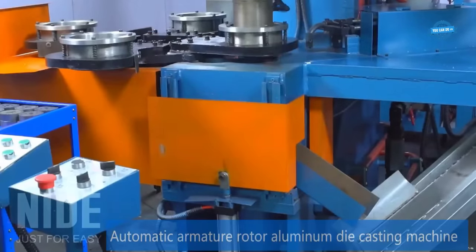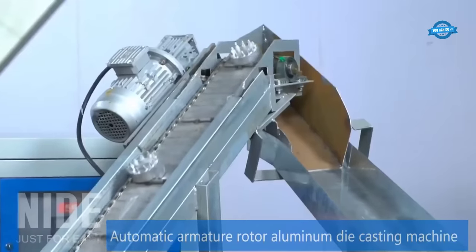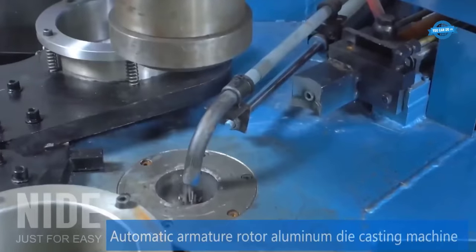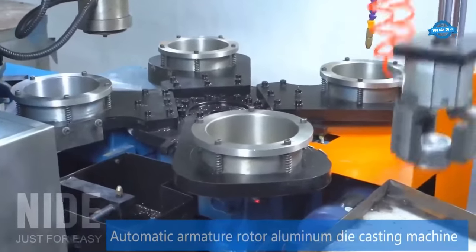The technical proposal for the line includes various components such as waste frame, heat preservation furnace, soup feeder, 850-ton die casting machine, integrated testing and marking machine, axle press, finished frame ejector, robot shaft setter, material storage disc, feeding truss, film processing table, and a dummy shaft return line.